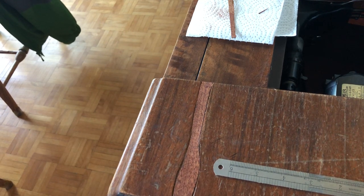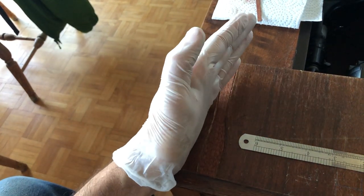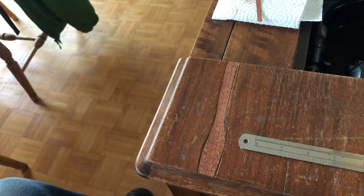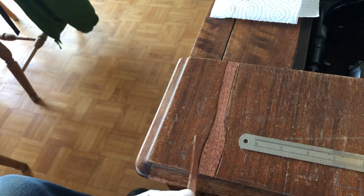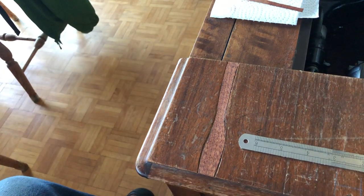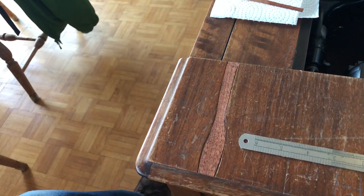Remember, this piece of wood has no varnish or shellac on it, and that affects the way you see the color. If you've ever had varnish or stain matched, you know what a strange experience it is trying to get that the same. If you look at it without the light hitting it, the color is very similar. I'm going to be experimenting — I've got a little test strip that I did and I'm going to put a little bit of shellac on that eventually to see what the final darkness looks like, and I'll decide what I want to add, if anything.